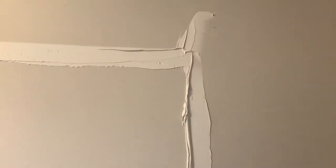All right, if you look back, it looks like a window. There used to be a window there. I patched it, sealed it up, but I didn't tape it. It was a quick job, obviously. When you're doing stuff for your own house, you cut corners, but the cracks came through. So throw your bead all the way around, and we're gonna place our tape inside.